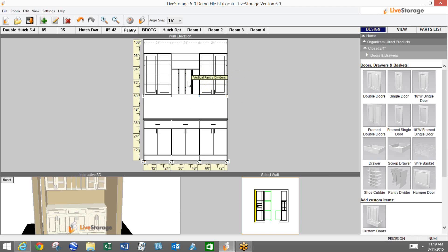When placing these, the best practice is to not put them at the very top of a tower or cabinet, for a couple of reasons. One is if you do have a cleat there, you're going to have to notch those vertical tray dividers to go around it. Also, the system holes on the side of these panels — that top hole is not consistent with everything else. So if you put them at the very top, you will have to trim those down by an eighth of an inch to fit between the two thick shelves. Best practice is to drop them down maybe six inches from the very top. You can put them at the very bottom or somewhere in the middle.